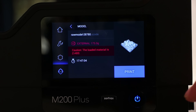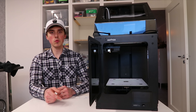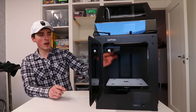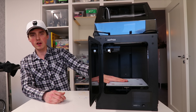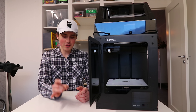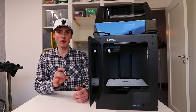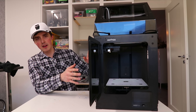It even shows you the model on screen. The cover is an add-on that filters smells and emissions. However, I've already come across a couple of problems — one being that a fan purchased separately blows air out while circulating air inside the printer, making ABS and other filaments warp more easily. I'm not a huge fan of the perforated board — it makes everything stick really well but forces you to use a raft, adding 1 to 30 minutes depending on print size. The software is a double-sided coin: perfect for beginners who don't want to mess with settings, but frustrating for experienced users who can't tune anything. It's perfect for beginners if you have $3,000 to spend.